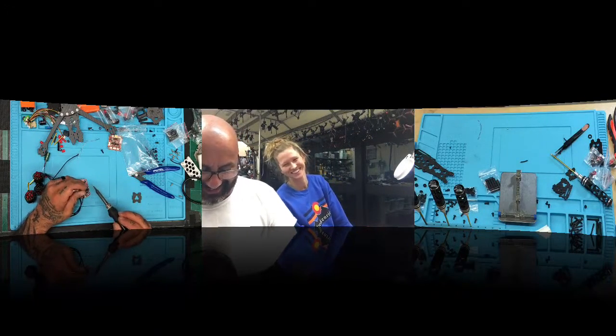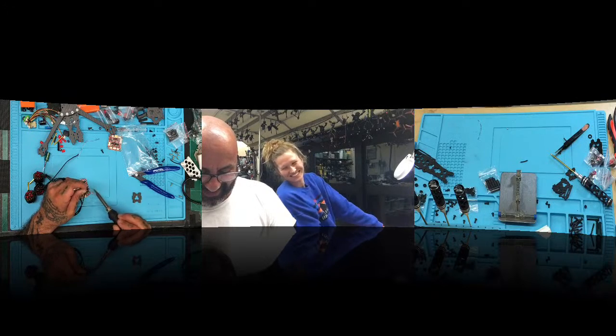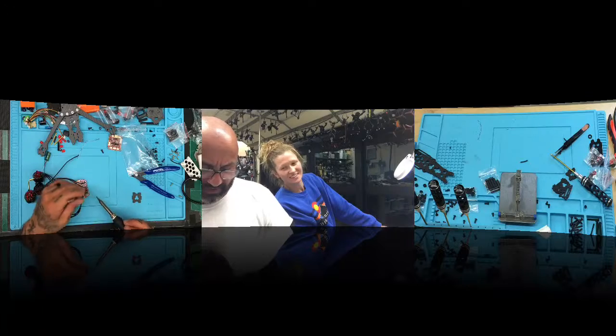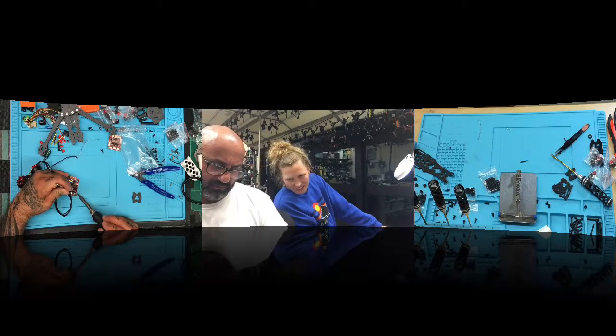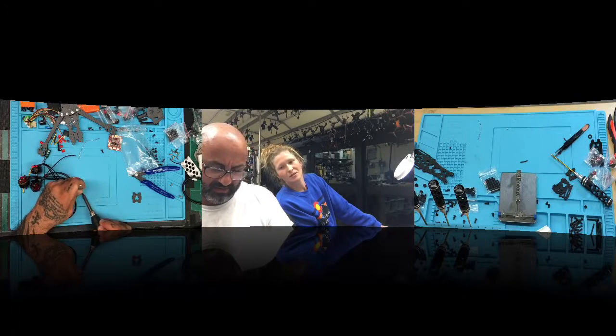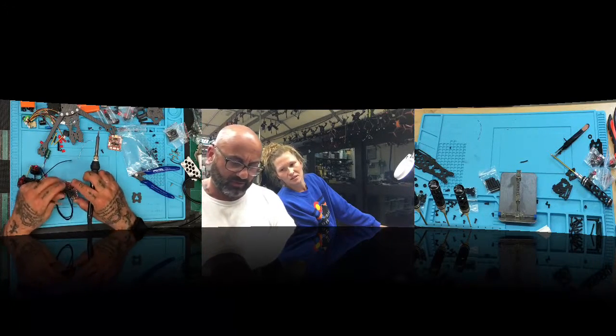Okay, and this one's probably not going to go anywhere because it's got enough solder to hold a tank. That one I would make sure. I'm just gonna straighten this out. This one is not good, so we need to fix that one. See, like this one here, it's all kind of messed up. You need to treat these like the pillows on the couch, okay? You gotta get in there. That's gonna hold. So you have 2 wires that need to be reattached, and I'll leave you to do those. Make sure they're tinned properly, and then you're good. Everything else will be great.